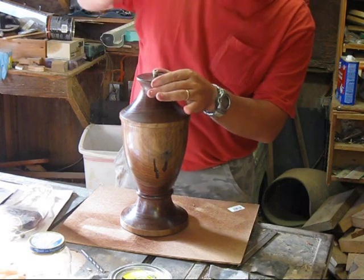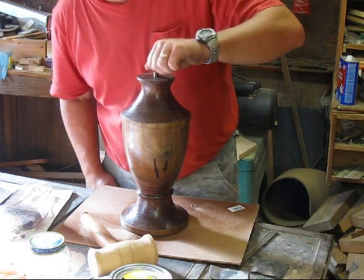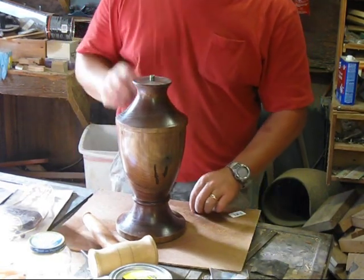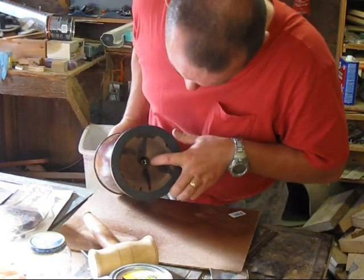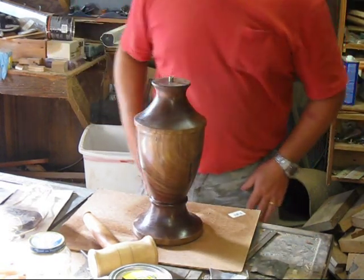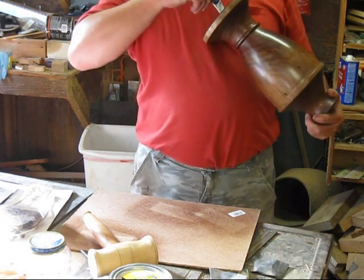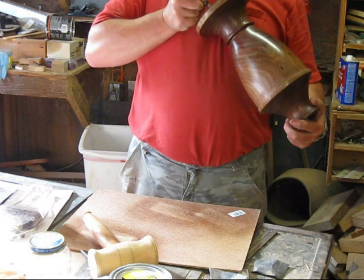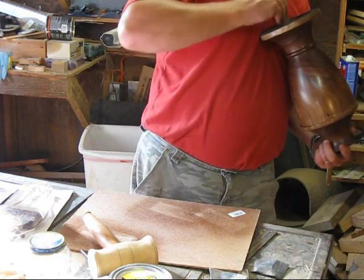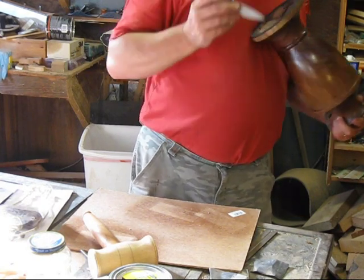I want to leave a little bit sticking out, and I believe that's going to be just about right. I destroyed the little coupling but I don't need it anyway. As hard as I had to beat that, I'm not going to put a bolt on the end of it. It did come through just about the amount I wanted. I'm not going to worry about putting the nut on the bottom - it's probably not going to get it really tight anyway. It said to use a 3/8-inch hole, and that's what I used, but buddy, it was tight.